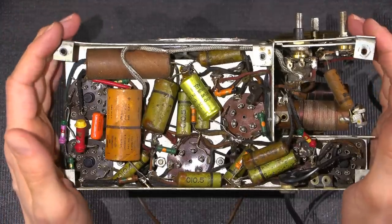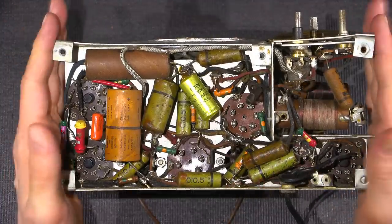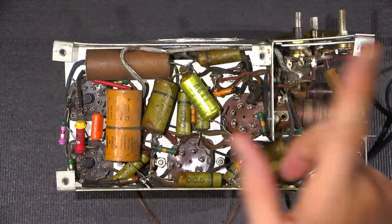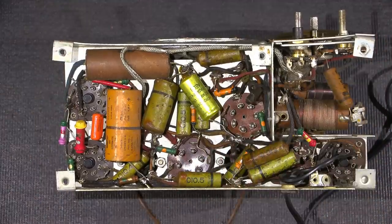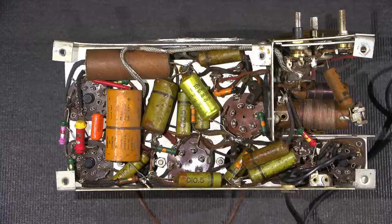Now, it wasn't uncommon to see nice big burn marks on the back side of the chassis, because with antennas way back in the day, everybody was trying to ground the chassis and then hook the antenna lead up to the antenna that they have outside the house. Now, if you had plugged this in the wrong way by accident and you touched a ground lead to the chassis of the radio receiver, you got a really big flash, you blew the breaker or screw-in fuse, most likely, way back in the day.